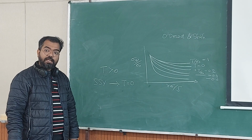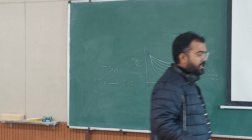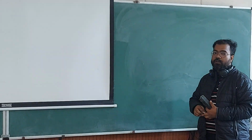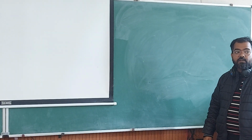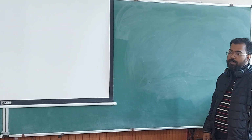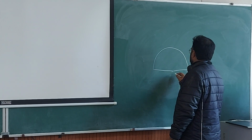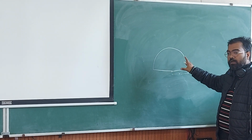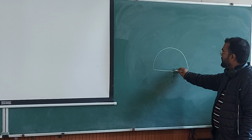Okay, sigma naught will be there in your calculation for normalizing. And how do we do it? These analyses are done by doing that modified boundary layer modeling scheme. Because you are looking at stresses very close to the crack tip, you are not supposed to model a CT specimen and 3-point bend specimen and have the effect of gradually decreasing or increasing element sizes away from the tip. Okay, so you take that curved circle at the crack tip and then you ensure that you're at the boundary. So for whatever material you are modeling, you have to ensure that if you use plasticity, then the plastic zone size will be much smaller.